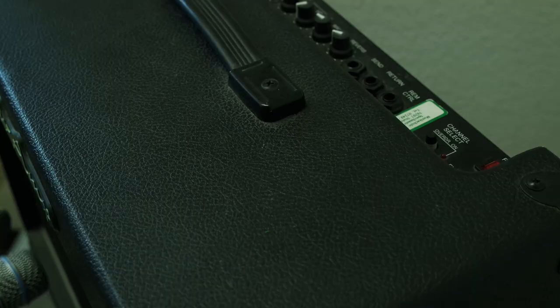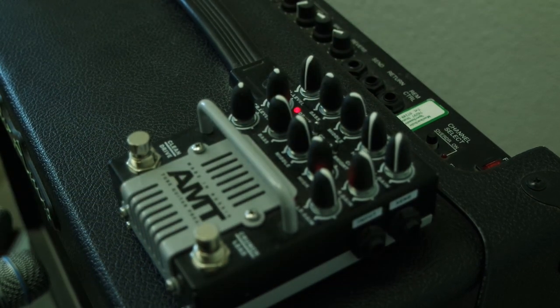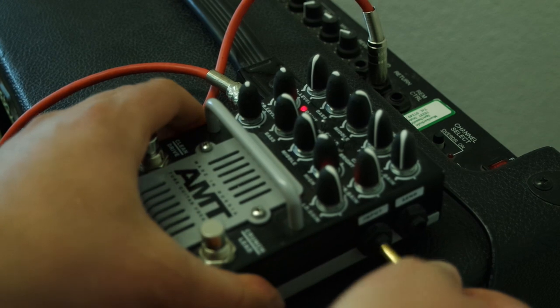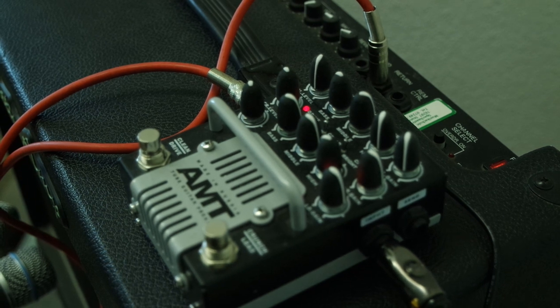The problem is, the club owners don't want to spend a lot of money on decent guitar amplifiers. And what they get are usually solid-state amplifiers that don't really sound good. And if you want to get some decent sound using those guitar amplifiers, that's what you use. You simply grab this guitar preamp and plug it into the return of the effects loop of the solid-state amplifier, and the speaker that's already in those amps is usually a 12-inch guitar speaker that has some decent sound. And you get some sort of hybrid amp. Use a tube preamp, solid-state power amp and decent guitar speaker and you get decent sound.